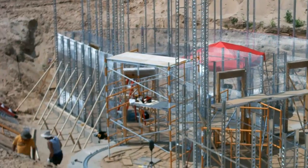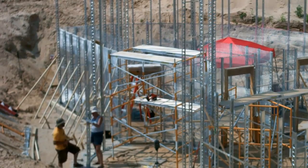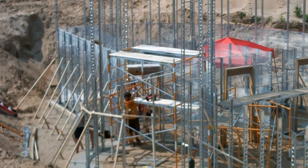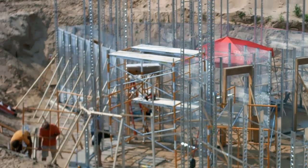After lunch we got back to the tower. The taller studs were catching the wind and we found it was easier to hold them plumb with a second person steadying at a point higher up. Then we got onto the easier 9-foot studs on the south side of the tower. Since the strap can't hold the second direction with these curved walls, we ended up cross-bracing to ensure plumb in both directions before strapping.